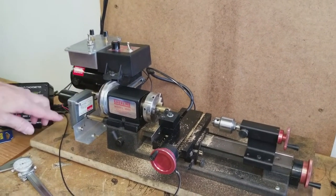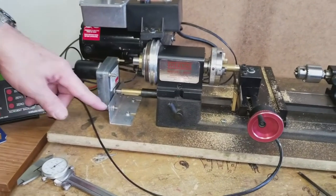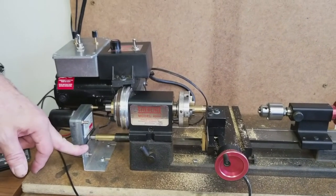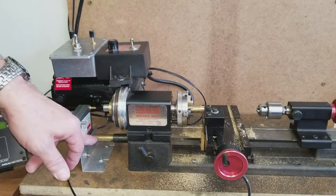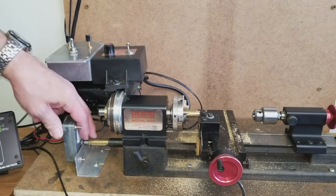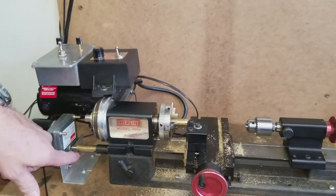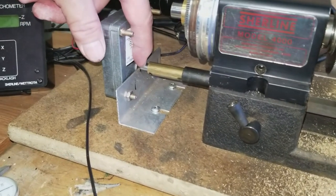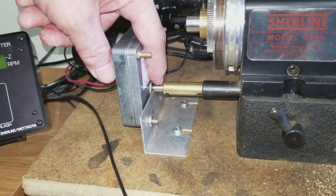The little motor is mounted on a 1/16-inch aluminum bracket that we made. If you're doing it yourself, I'd probably go with 1/8-inch, because it does the job but would be a little steadier. In between, we've got a 1¾-inch piece of brass rod. It's been drilled for the motor shaft on one end, and has a set screw holding it on that end, because there's a flat on the motor shaft. The set screw is against that flat to secure the shaft.